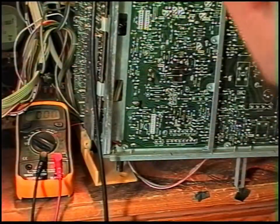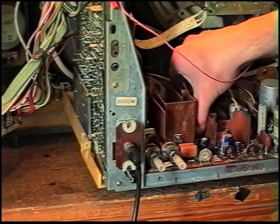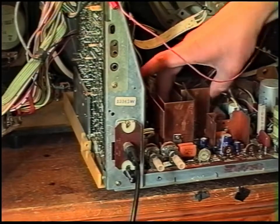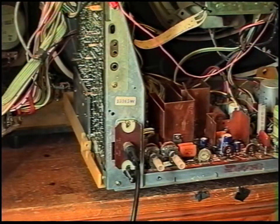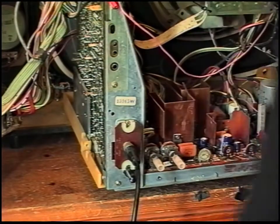The resistor's starting to smoke. I'm going to unplug it. That's pretty hot, that. Although it does run quite hot. Although the transistor itself's not mega hot. Wow. That 4.7 ohm one in series with it is insanely hot.